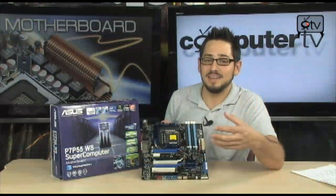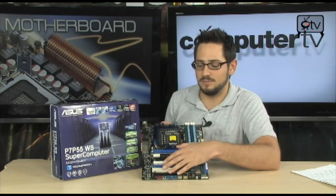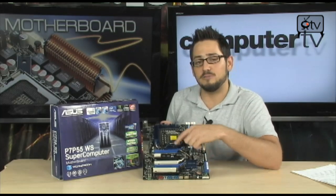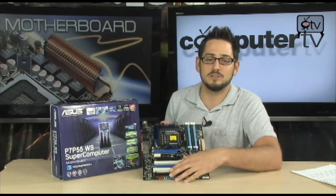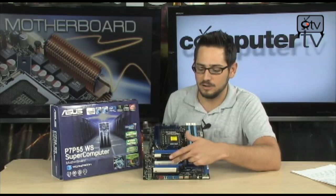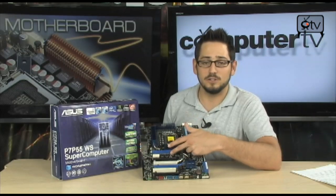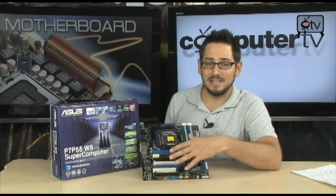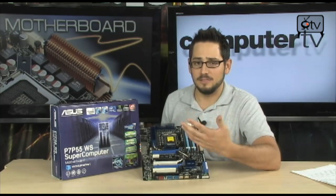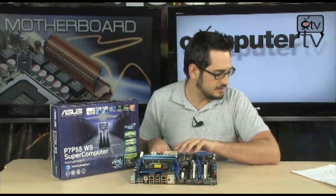On top of that, there's still more PCI Express connectivity on this board, because they figured out a way to bridge it over to the P55 and use P55's bandwidth to send even more PCI Express connectivity. What will basically happen on this board is people are going to load it up with Tesla cards — maybe three or four Teslas — and then use a Quadro to get their graphics output to their monitor. That's what this board is basically designed for. Now let's talk a bit about the PCI Express compatibility, because it's a little complicated.